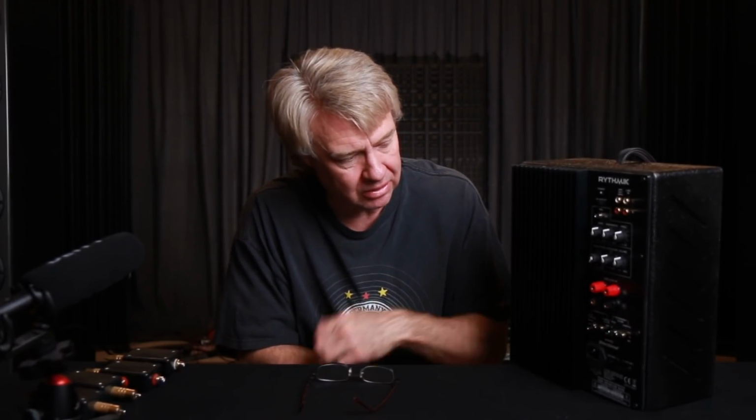A lot of those movie soundtracks will really emphasize something down low, a big explosion. They're wanting to be that big wow factor. And just when you think you've got things balanced, all of a sudden a lot of subwoofers just completely bottom out. And that's just typical of a lot of those movies. So on movies, you may want to set it to 20 or 28 hertz to minimize just how much excursion the whole system's going to see when you start playing those big explosions and stuff.